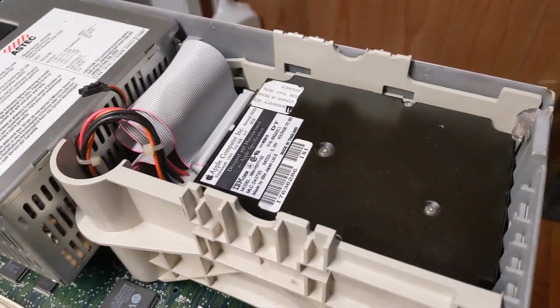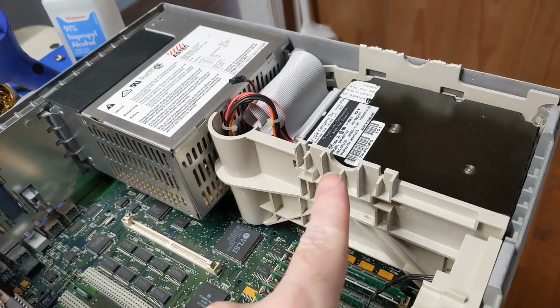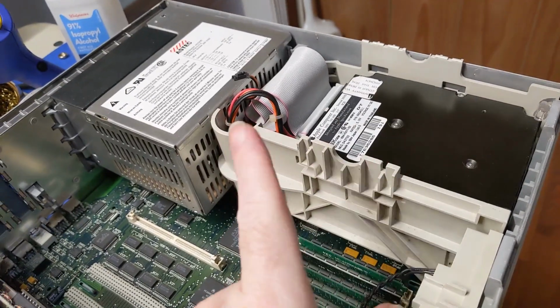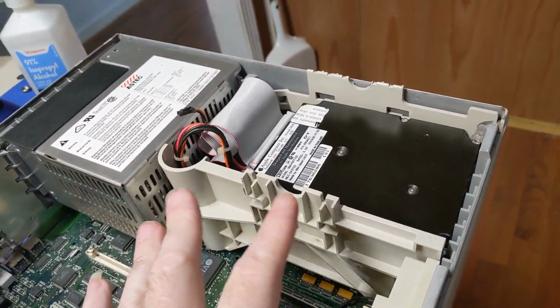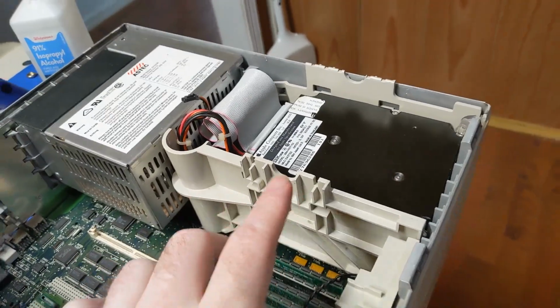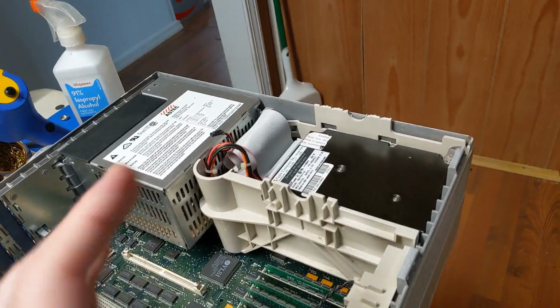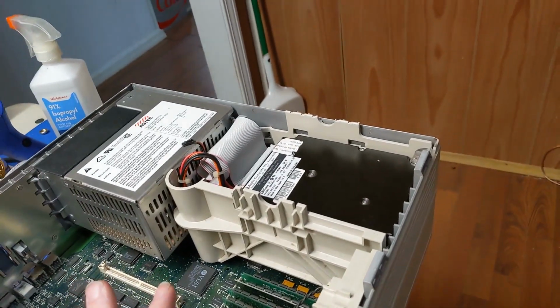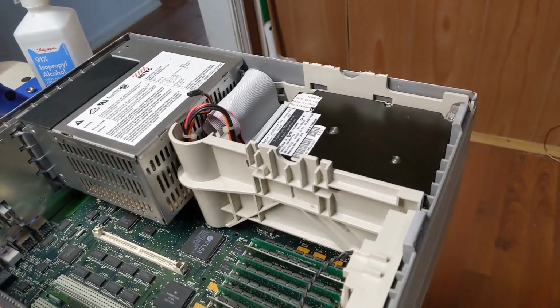So, the Western Digital drive, I had two of them that Steve gave me. One of them was definitely dead. It was going ka-clunk, ka-clunk, ka-clunk, and then that was it. The other one seemed to work, but it kept giving me the arbitration error, so I took it over to my bridge machine. I was able to format it and use it no problem. And the other drive was indeed dead. But I guess that drive is too new to work in this machine.